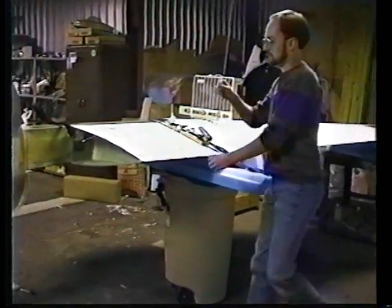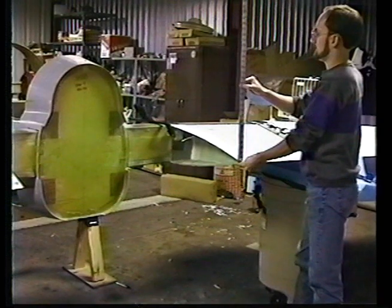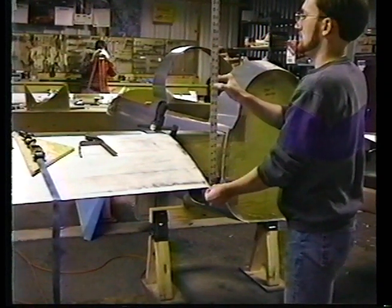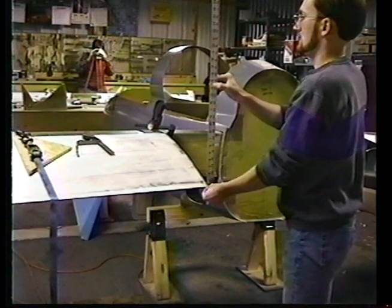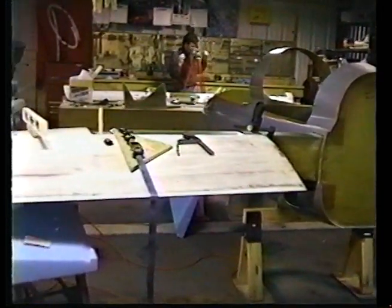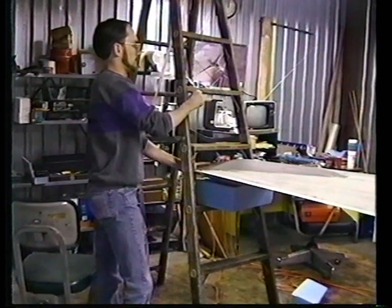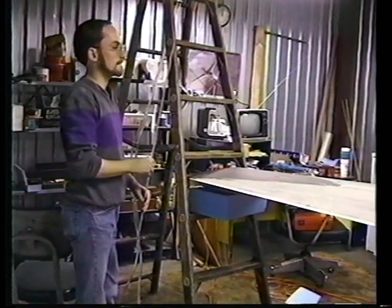Now your dimensions are going to be the same, all depending, of course, on how high you have your transit set up. Here I've got 24 and the width of the line. Here, 23 and the width of the line, below 24. 23 and 15/16ths. It's almost 24. And we have 23 and 15/16ths again. So we are plus or minus a 32nd of an inch difference from one wing to the next. We've checked with the levels.